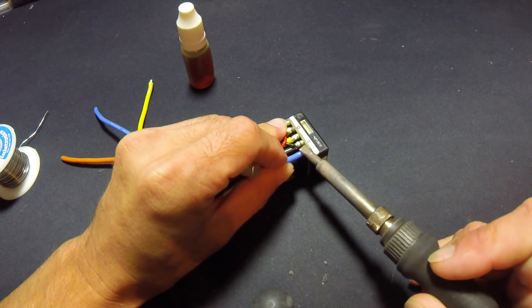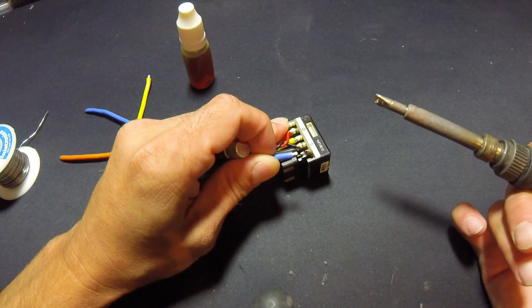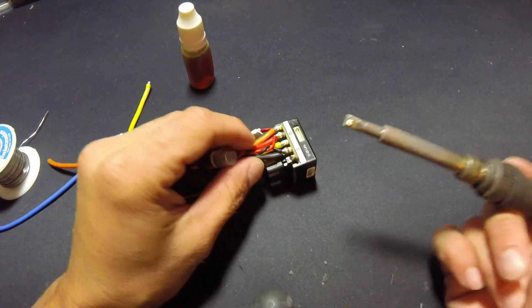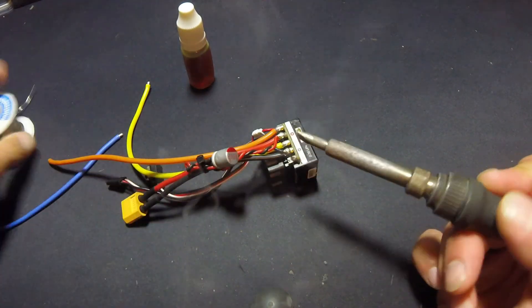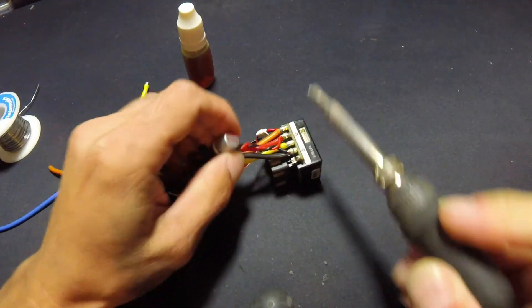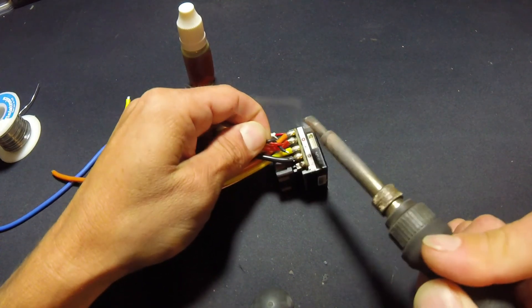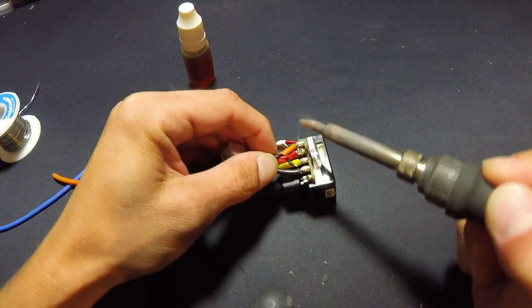The main thing is you start with a little solder on the tip, get it to flow — one thousand, two thousand — and it comes off just like that right out of the cup. If it doesn't happen that fast, it usually means you need a little more temperature in your iron, maybe flow a little more solder in there, or add a dab of flux because that'll help things flow along a little bit nicer.